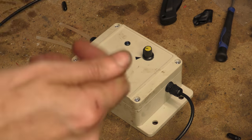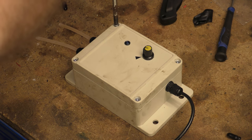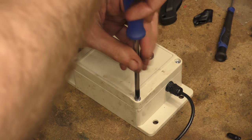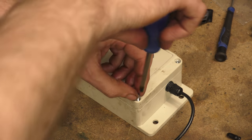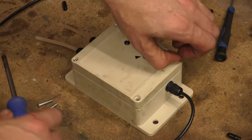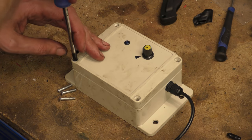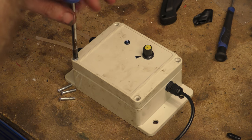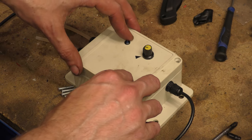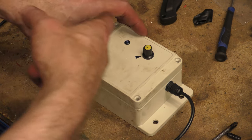I did ask before I opened this to make sure it was okay to open it, because we know what happened with the afterburner. If somebody wanted to steal this design, all they have to do is buy one and reverse engineer it. So we shall open it up. Now, I know some of you thought this is a peristaltic pump inside - it is not. Peristaltic pumps work with a rotor that squishes a hose and forces fluid through, and most of them use a silicon hose. Silicon turns to sauce if you add fuel to it, so that probably lasted about 10 minutes of testing. If you use a soft PVC hose - granted they are fuel rated - the constant rubbing of the rollers on the hose eventually splits it and could empty your fuel tank in the box.